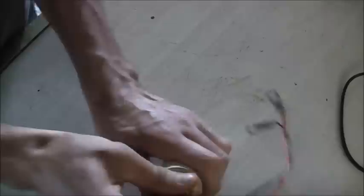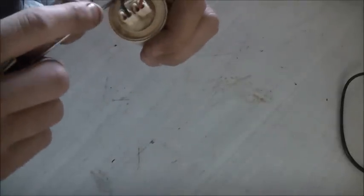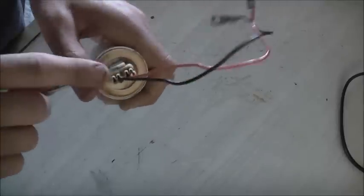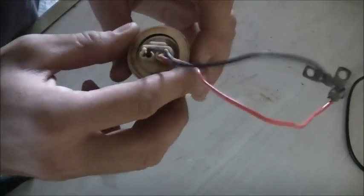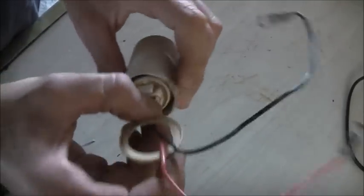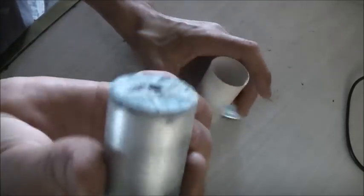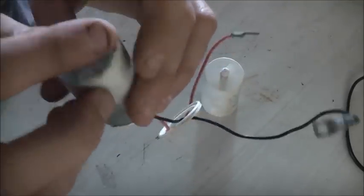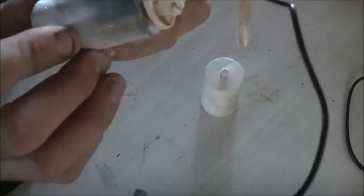Opening these up is quite easy - just pop it open with a little flat screwdriver. There's a ring and an inner part that just snaps off. That holds the assembly down which holds the innards - which are actually quite hot. It doesn't smell burnt but it certainly is hot. It actually looks like it's had moisture in it - there's corrosion on the rubber. It's partially shorted.